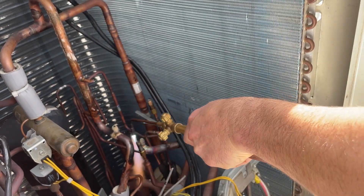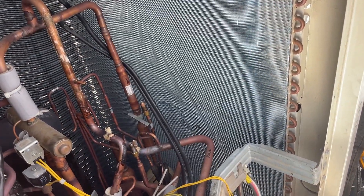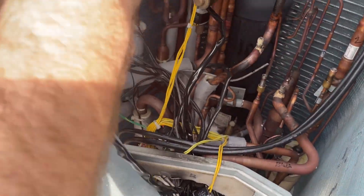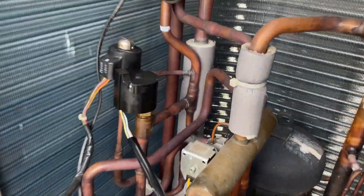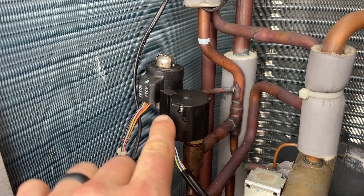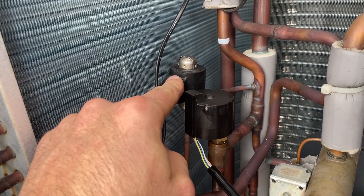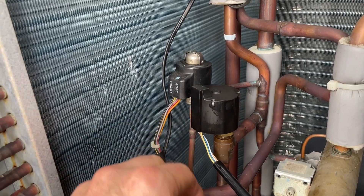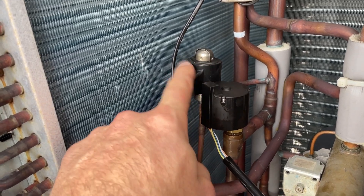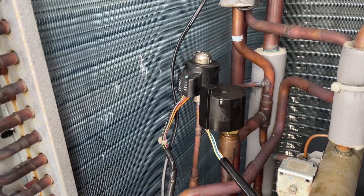There we go — gradually heat around a bit. By the way, the other thing ol' Ham Hands is doing here is replacing these EV powerheads. These have a stepper motor in them, and I'll show more about that in a minute. These are just like a magnet style — you've got to take these off and clean them, and then we put silicone grease in there to prevent the corrosion. What the corrosion does is interfere with the magnetic field, and then it can cause these to get out of calibration. But these fail all the time, and I'll talk more about that in a minute.